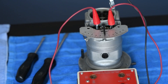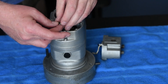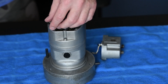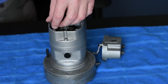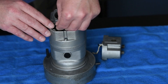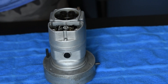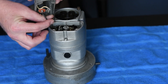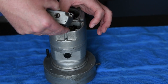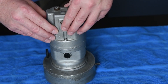For the final installation of our wire, we want to refer to the TCM manual on the proper orientation for this wire. For our main contact point assembly, we want to bring this around and then attach this to our points. For the top housing, we have a capacitor wire that is going to go to our points, and then our leg wire is going to go to our secondary points, and then we can go ahead and reinstall our top cover.